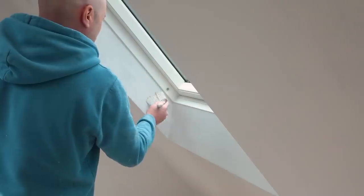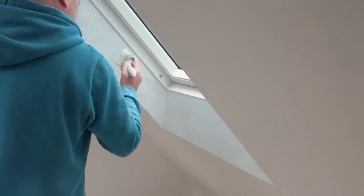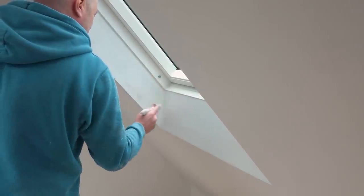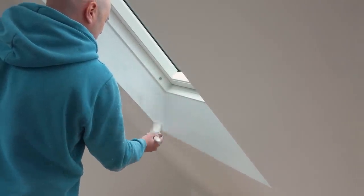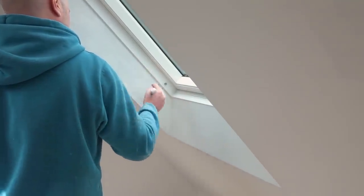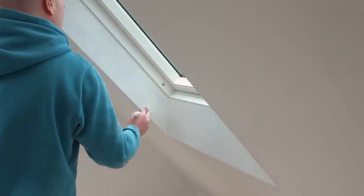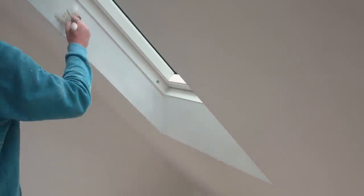It's always the same when the sun's out - it's drying as you're putting it on and you get a really prominent set of lines going through it. I like painting fresh plaster but it is a pain to cover, to be honest. You have to build up the coats. Once this one's drying you'll notice a difference - sometimes it goes on a bit see-through and then it dries better than it's actually going on.